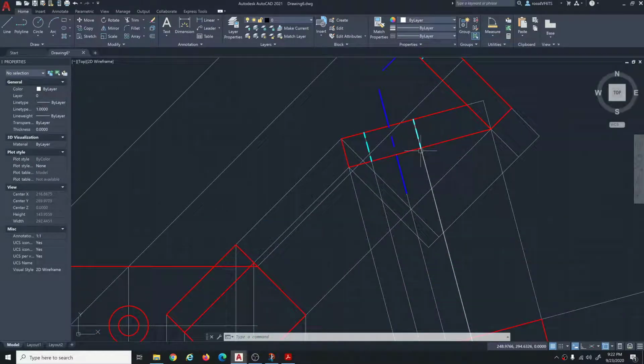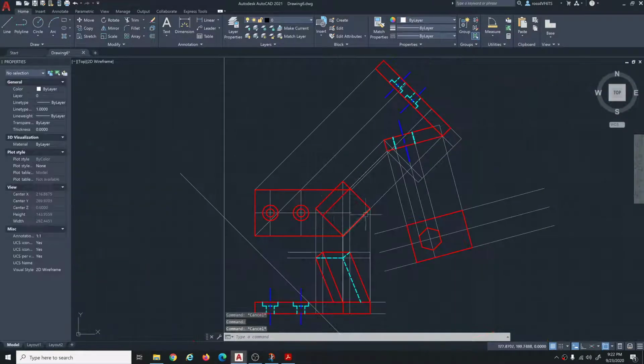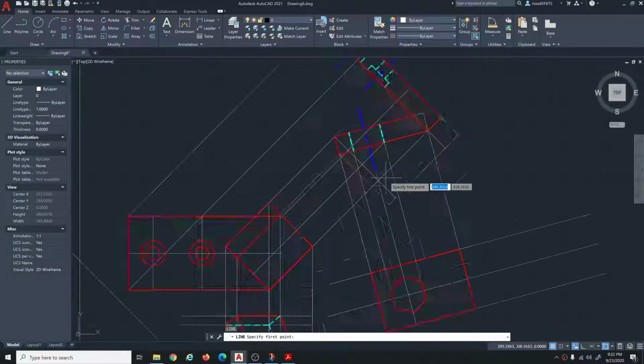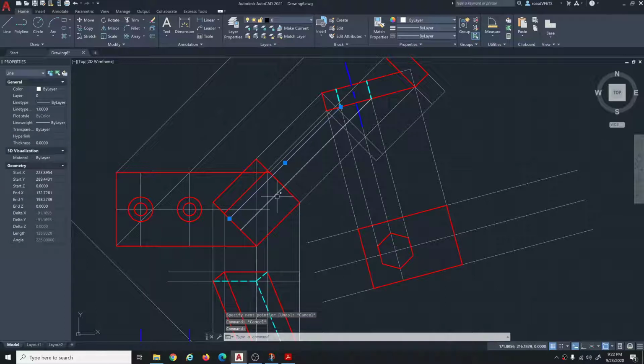What are we doing? Oh, okay. So I've got to project from just the front face of this thing. Let's draw the hexagon on the front face, which is in here, right? For the flange on the top view. So line from here perpendicular to that, and then another one from here perpendicular to that. Okay, so the hexagon is in between here.